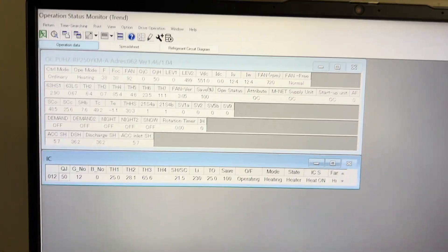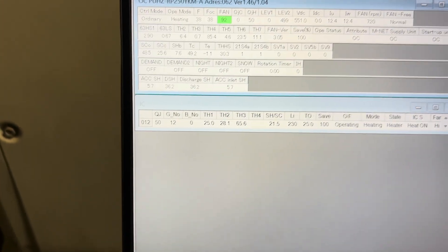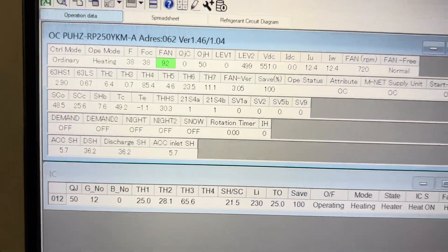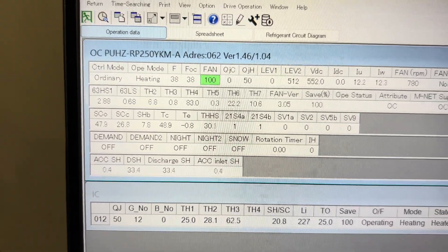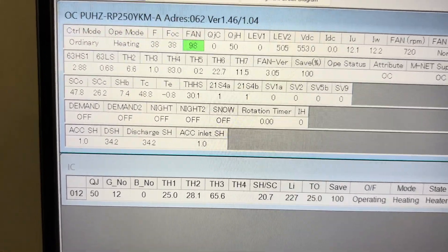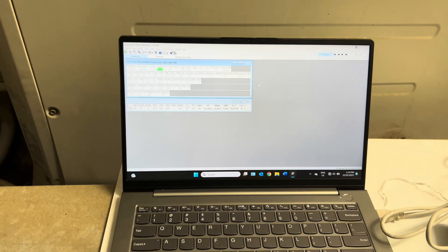So this is that unit — the one with the crazy duct run. TH7 is our ambient temperature but it actually feels very cold in here — it's not 11 degrees outside, it's probably like 18 to 20 degrees. Those sensors are getting a false reading. Because of that, the fan is just running its ass off — it does not drop below 90 percent. It's running flat out to maintain that target. Anyway, I wanted to get a bit of data on that as proof. Now I'll shut it down, kill power, change those dip switch settings and see if that makes a difference.